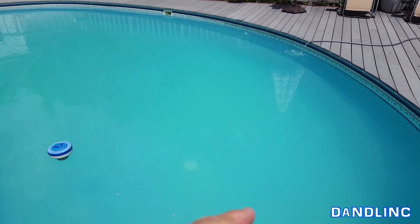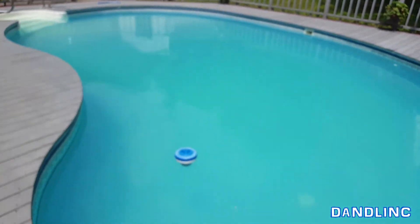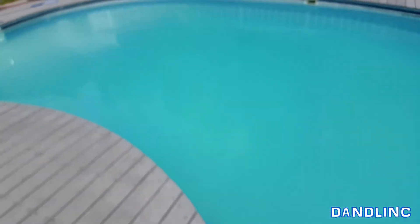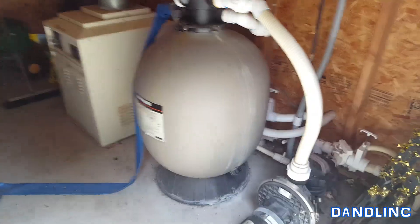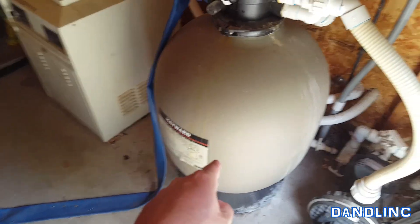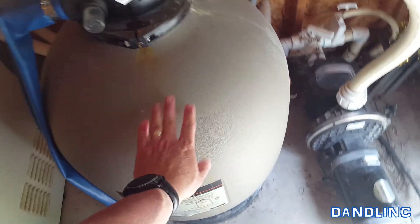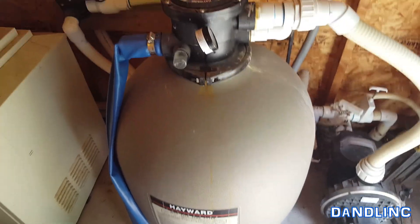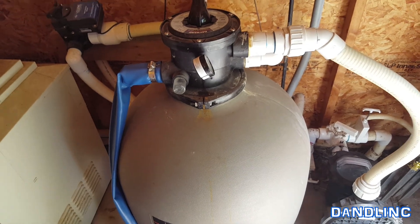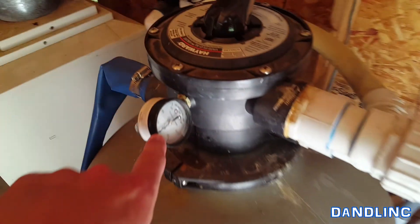As we backwash, we're going to run pool water in reverse through the filter in the shed. This is kind of a principles video, so I'm going to show you what we're going to do — we're going to reverse the flow of the water. Here's the pool shed, and this big thing is our filter. The water runs through the filter, which has a matrix — in this case, millions of little glass beads that trap particulates from going back into the water.